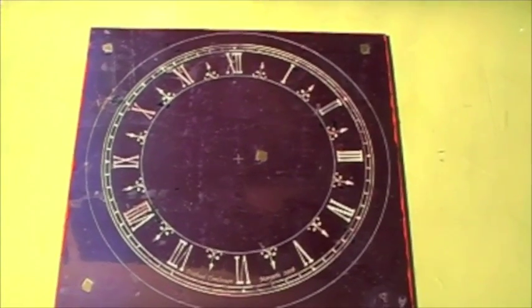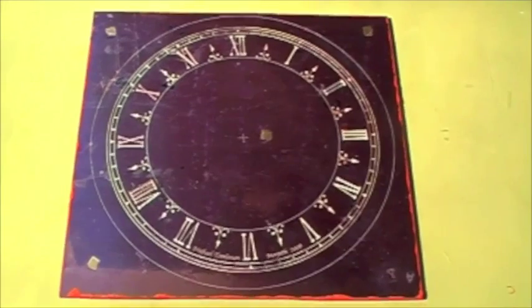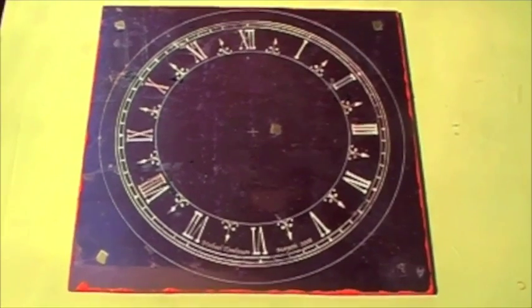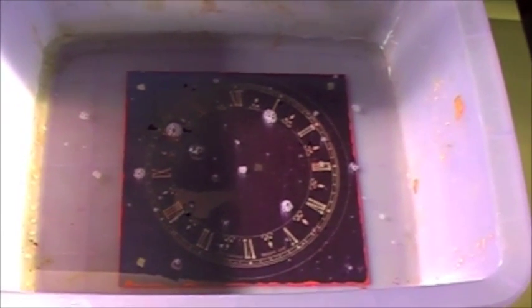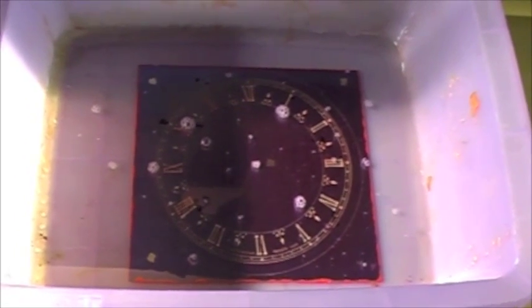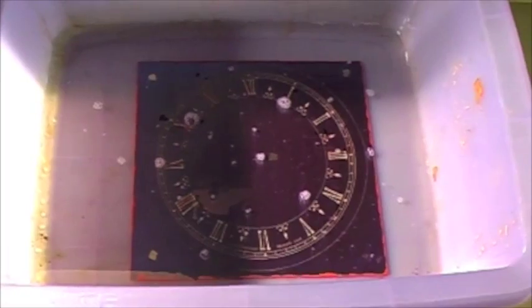The clock face has been etched and here it is still covered with resist, looking rather scruffy straight from the etching tank. You can see where the little plastic spacer blocks have been knocked off. It now has to have the etch resist removed, and we do that by putting it in a bath of very strong washing soda — a saturated solution. Here's the plate submerged in that stripper solution; it will be there for about 20 minutes and the coating of resist will just float off the surface and can be simply washed away.